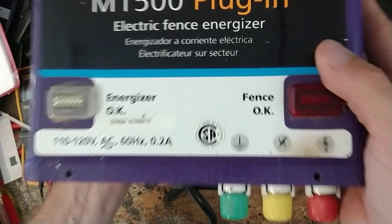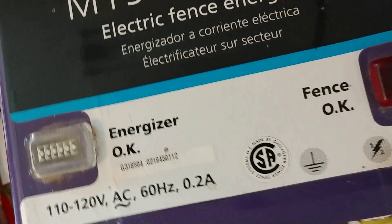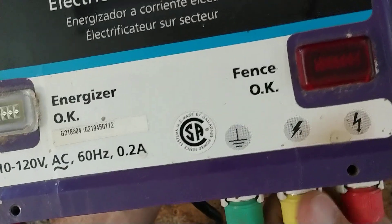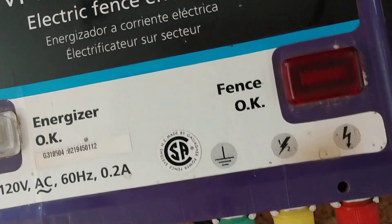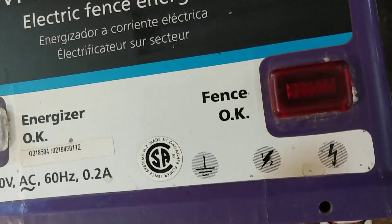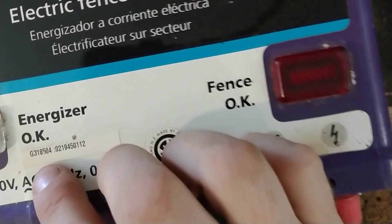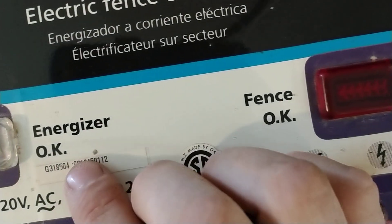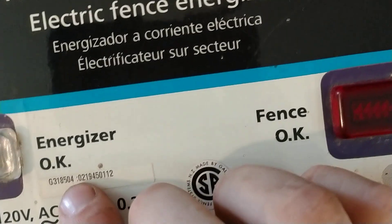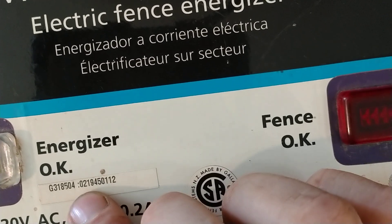I'll talk a little bit about the serial number of a unit. On most Gallaghers manufactured 1999 and newer — maybe 1998 and newer might be the cutoff — they had a date code tied in with the serial number. Some brands do this and some brands don't; it just depends on the age or the brand in general. When you look at a Gallagher unit like on this one, or even a newer model nowadays, look at the back of the case. They usually have a sticker on the back. Look for a long 10-digit number starting with a 0 or a 1 — like this one says 02. Don't worry about the G numbers; that's a product code for the energizer itself. The first two digits is the year it was built, so 02 is a 2002 model.